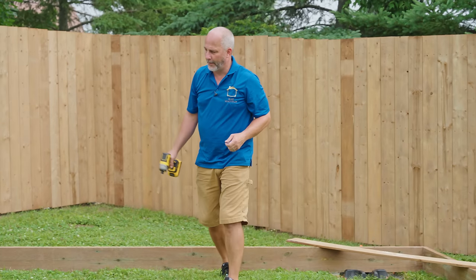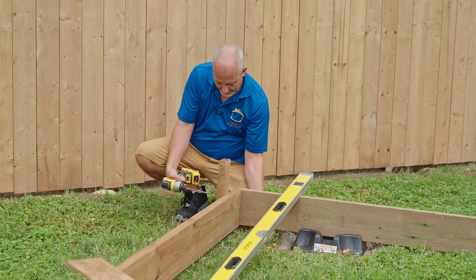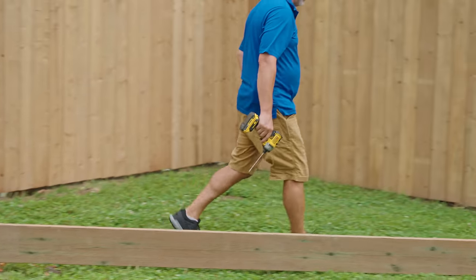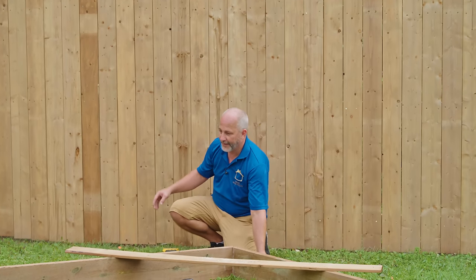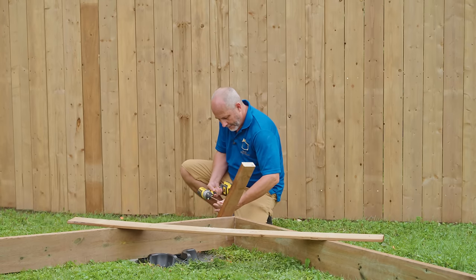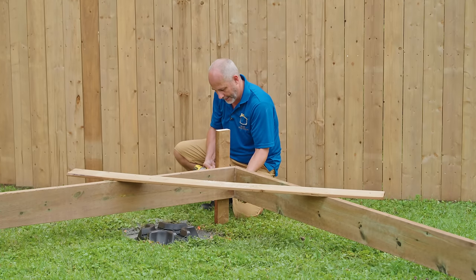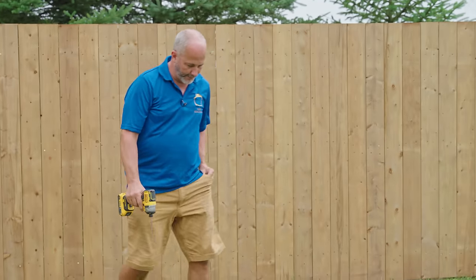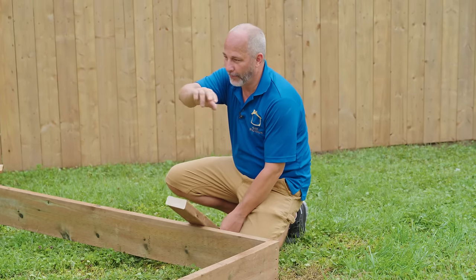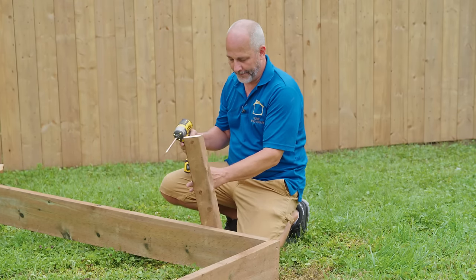Now we're locked in place — we're ready for our next step, and that is to level this bad boy. Here's how you level off a deck when you don't have four or five hundred dollar laser levels. Temporary screws — you peg the corners looking at what you think is about level. You can eyeball this pretty easily. Once we get this started, making the minor adjustments with the level is easier, but you can't just level one end and be perfect right out of the gate — every corner has to be up in the air, give or take where you want this thing to go.